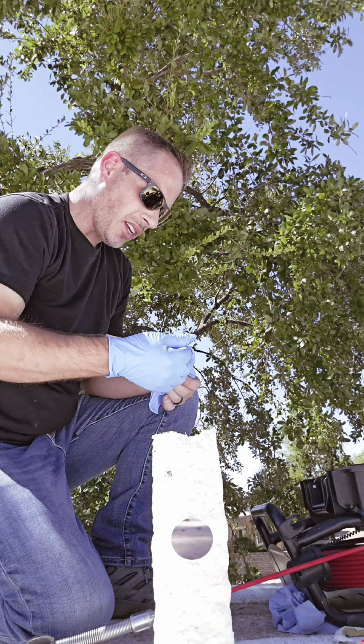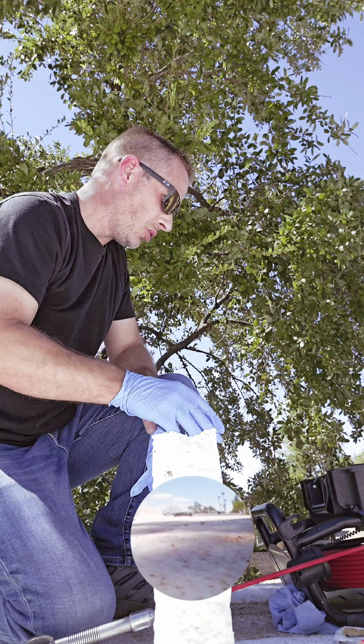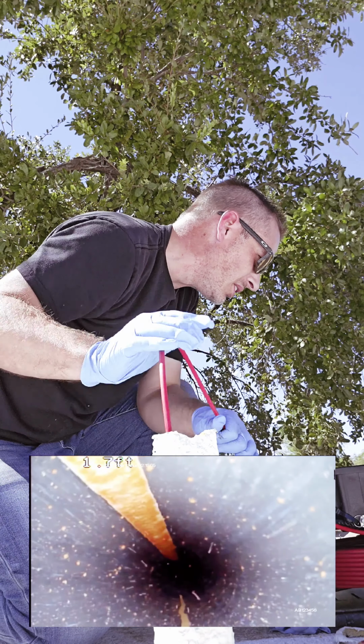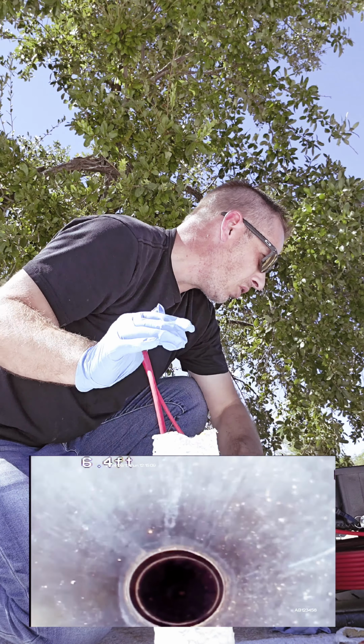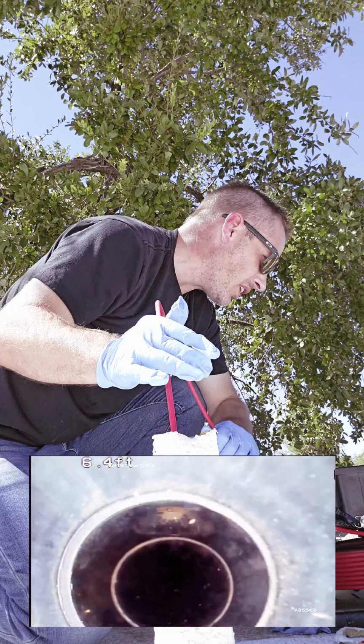Sewer camera inspection at 10895 East Emerald Drive in Sun City. We're on the roof at a cleanout, right near the edge of the roof because the main plumbing stack in the middle of the roof is clogged by a condensate line, and I can't get my camera head down through it. Now we've opened this line up here, cut off some of the foam so I can get my camera head down here. We're gonna proceed with camera inspection now. Hopefully I can get down into the drain pipes through this bend.